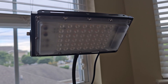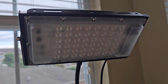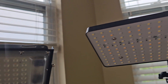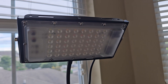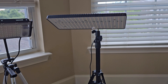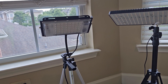Now jumping over to their older model. The LED board on this one is a lot smaller, and we actually have these focused reflectors over each LED — they're kind of encapsulated within a little lens. Whereas the 2024 model has just raw LEDs sitting on a board. So as you'd probably expect, the light from this one is a little bit more focused, whereas the 2024 model scatters light more. It's still very bright, but this one has a tighter beam pattern.